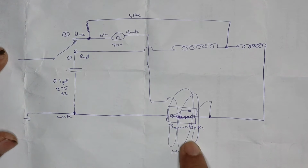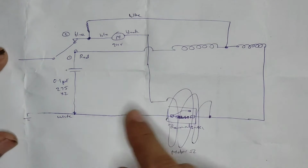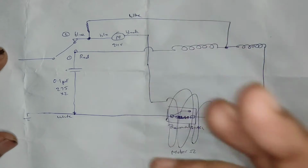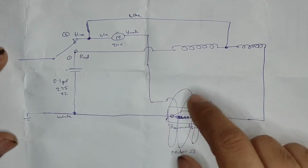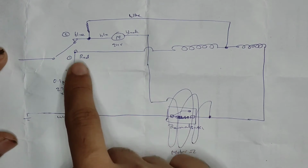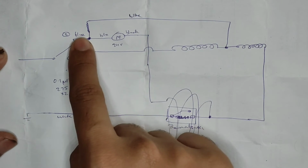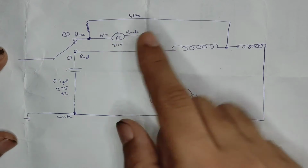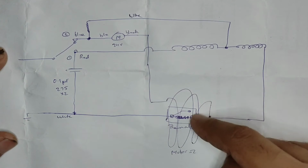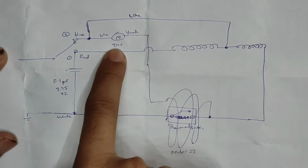So this is the reason why when the motor is on, as you have already seen in the previous clip, when it is in switch position 1, this part is getting hot. You have already seen that. And when it is in switch position 2, it gets even hotter, like from red hot to orange hot, because previously it had more resistance in it, so it reached only red hot. Now the AC mains is going straight to here, which means more energy is available, less resistance, more current. This thing will get even hotter, because now it has to drop even more voltage across it to make it down to 24 volts.